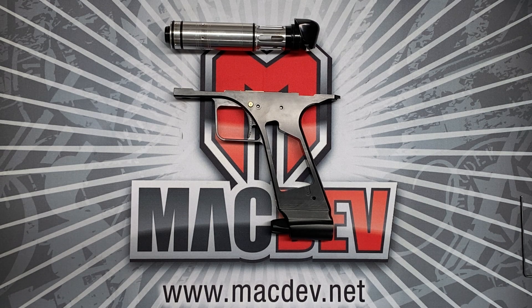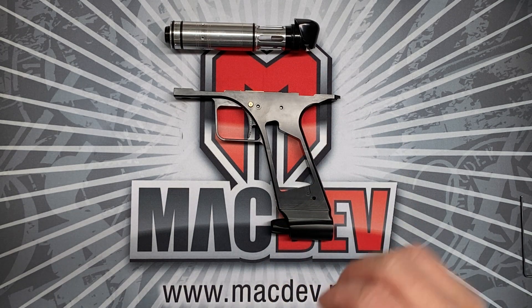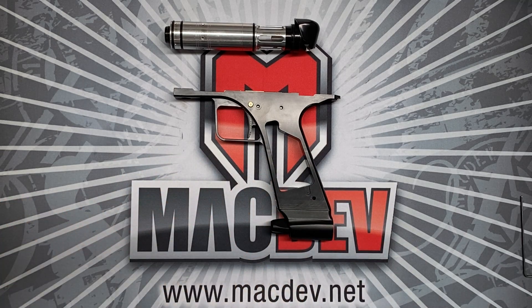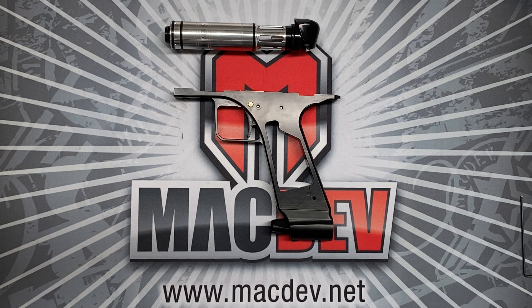So how have we resolved that without moving to a more complex drive? By using the XDR drive with our Mech frame. The way we've done it is that the Mech frame has a pneumatic feedback built into it — that is to say, when the drive has completed the shot phase of its cycle, it communicates that to the Mech valve, and the Mech valve then switches the drive to return.